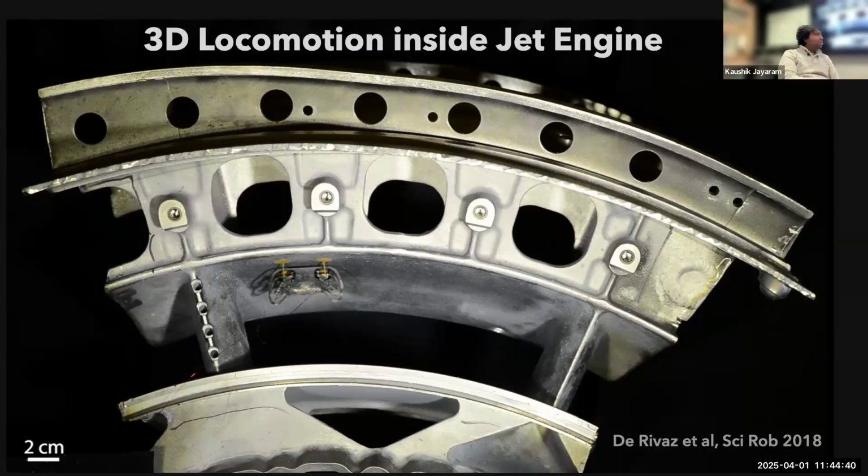But I'm not really going to talk about this. In my group currently, on electroadhesives, we've been trying to integrate a bit of active and passive mechanisms. So we're basically taking these electroadhesives, the classical ones, like the ones I'm talking about, and putting a little piece of PVC gel on them. So this gives you that little bit of compliance. You can texture them in a gecko kind of fashion if you wanted. But the advantage is it helps with some of those surface asperities. You can conform to a large number of surfaces.